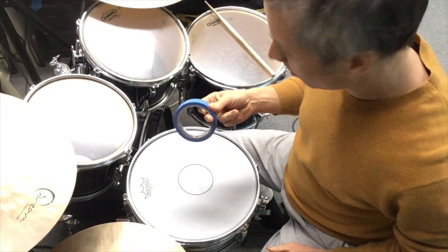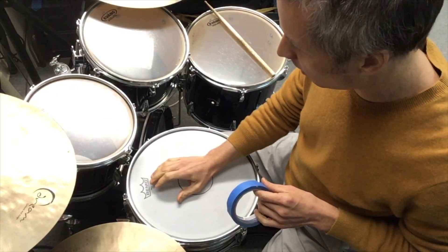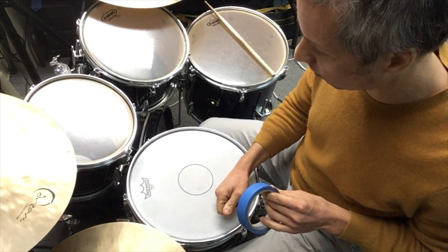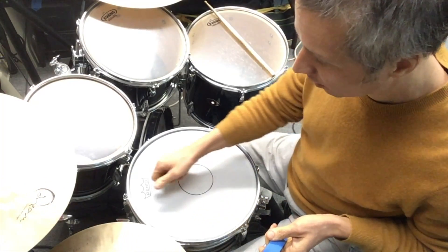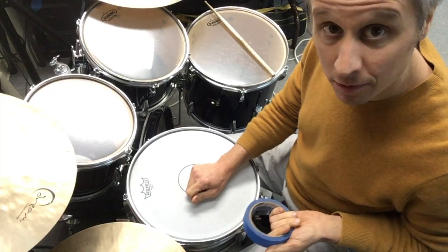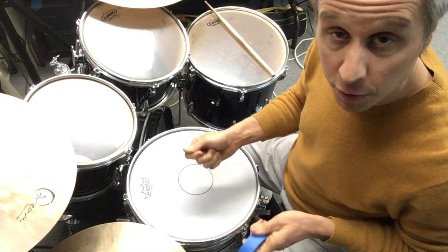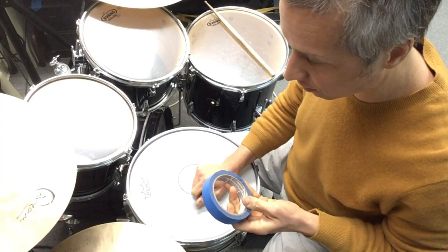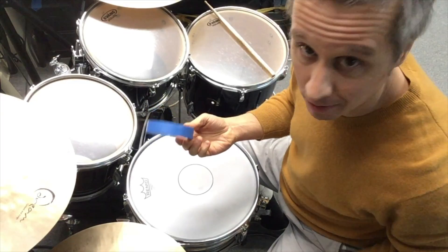There's always tape. This is exterior grade masking tape. You can stick it on the heads and as long as it doesn't stay on there for a super long time, it's not going to leave any residue when you pull it off — which is what we want. If you were to use duct tape, that would be a really bad choice because it leaves a sticky mess. There's also a tape called Gaffer's Tape, which they use to mark stages in theater productions. That tape works really well, but it's special order and pretty expensive. So I just use exterior grade masking tape.